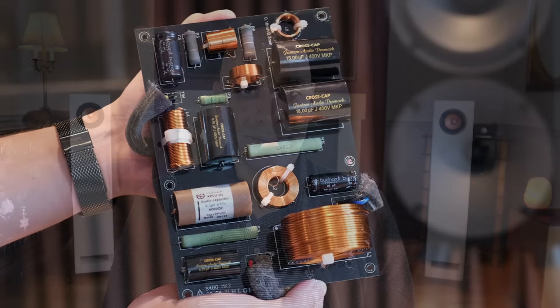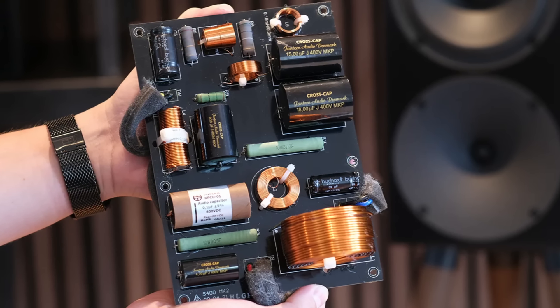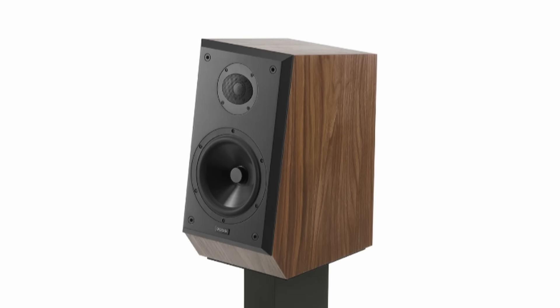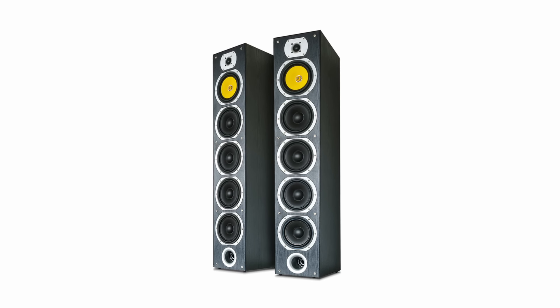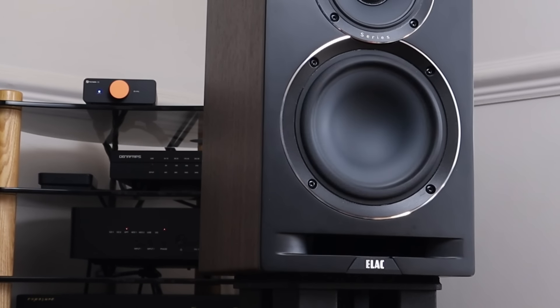Harley's design philosophy is simple: to produce a speaker that uses a single drive unit capable of handling almost the entire frequency spectrum, free from any electrical components, so the amplifier couples directly to the back of the drive unit — no passive resistors, and in particular no capacitors and inductors found in filters and crossovers. Even speakers with low order crossovers of minimal parts aren't totally phase coherent. The subtle shifts in timing, especially around the crossover region, result in many multi-driver speakers sounding artificial. Single driver speakers have their problems too.